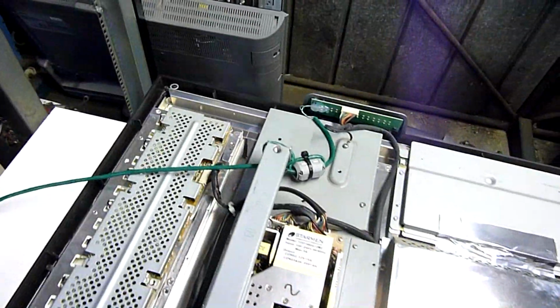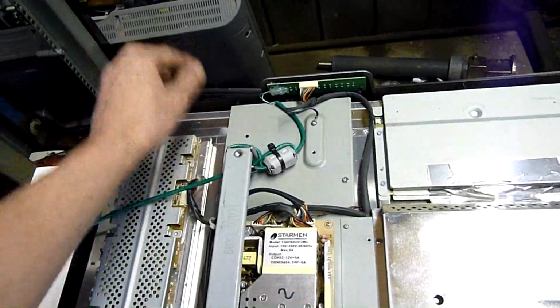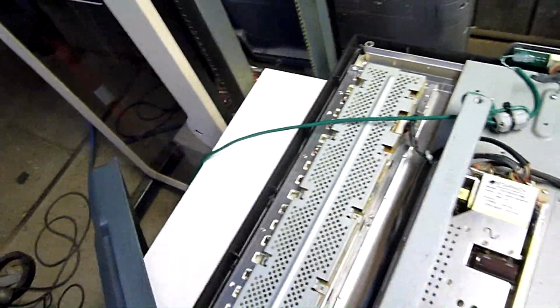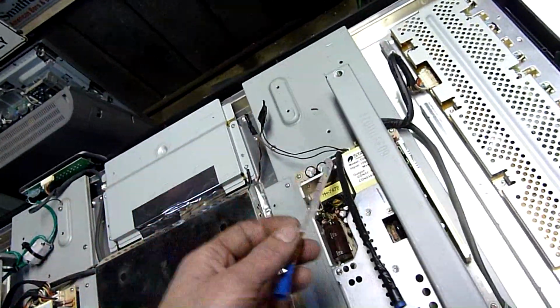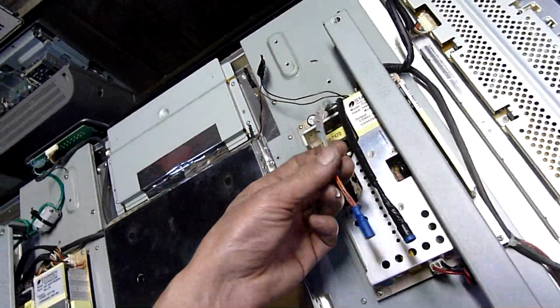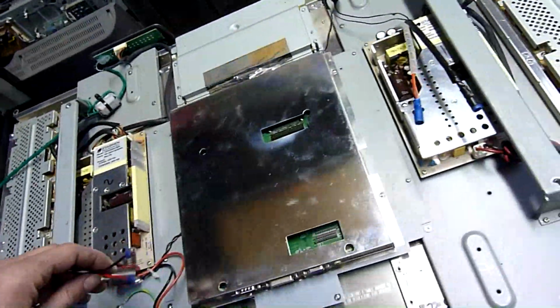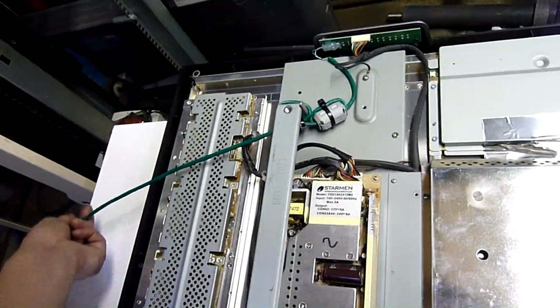Okay, so I didn't have any shielded communications cable, at least not thin stuff floating around to use, so I used a bit of old Ethernet cable offcut. It's power, I can disconnect if need be, just power supply trigger, nothing special there, and that should work quite well. Just out of red heat shrink, but I know the wiring inside this thing. I'm the only one who's going to be working on it, so it should work quite well actually. I'll have to wait till my cameras and things come in to do a test, but it's all there.